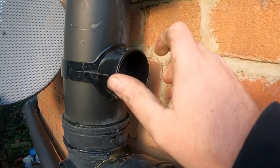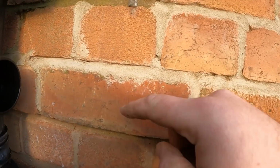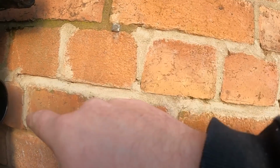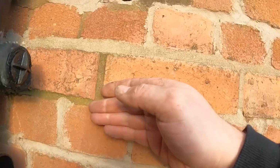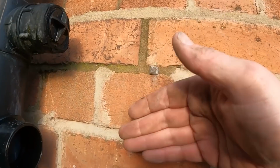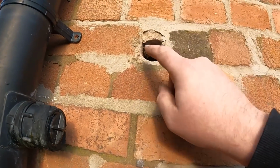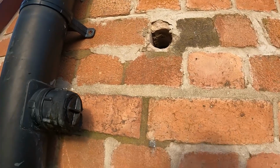Then we've got a reducer down to 1.25 inches there, will come off, and then elbow 40, depending on how it's going to work, because the brickwork's all different levels here. You can't really see looking at it, but there it's stepped off a little bit, so it'll probably be an elbow there, straight up, elbow in, and connect internally.